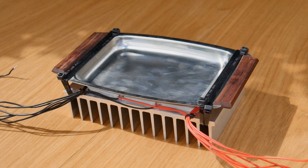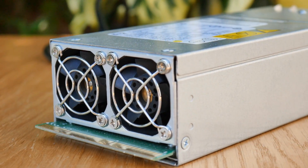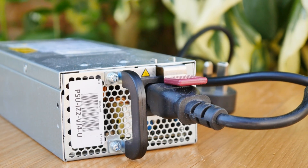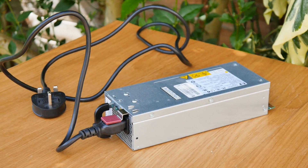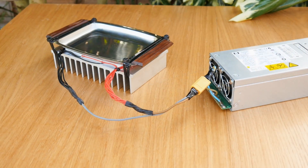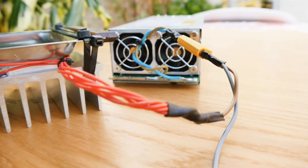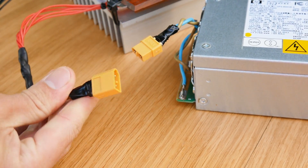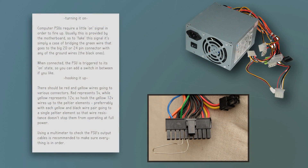The last thing to do is sort out the power supply. As all six peltier elements draw about 400 watts, we need to use a pretty beefy power source. Luckily, computer power supplies have been able to deliver this kind of power for a long time, so you should be able to pick up a second-hand unit for very little money. I happen to have a 1000 watt server PSU on hand, so I'm going to be using this instead. The power supply's 12 volt output can simply be hooked up to the peltier elements, with red being positive and black being negative. I'm using an XT60 connector in between so that they can be disconnected easily. If you do use a standard computer power supply, you can find a guide on how to wire it up in the description.